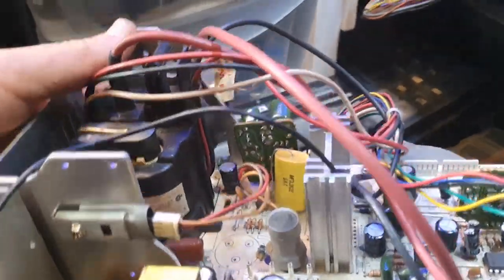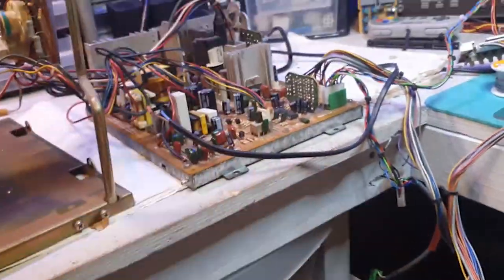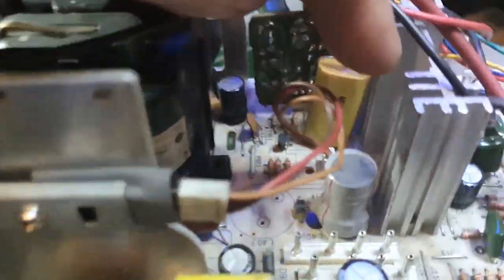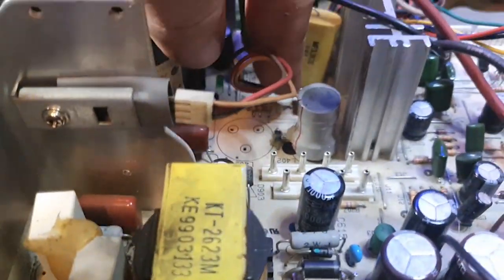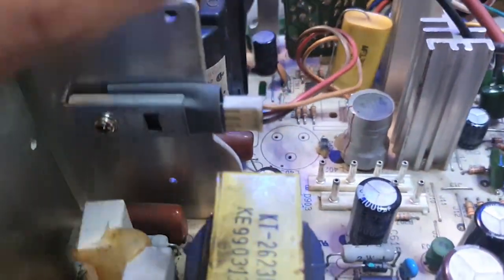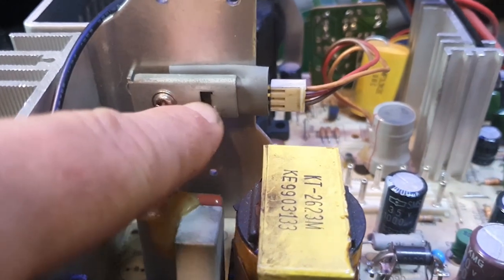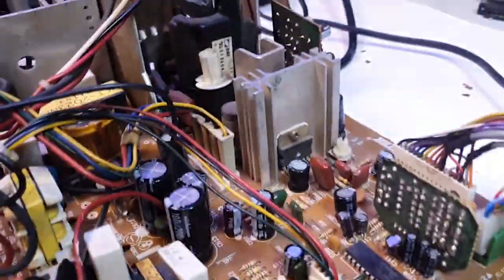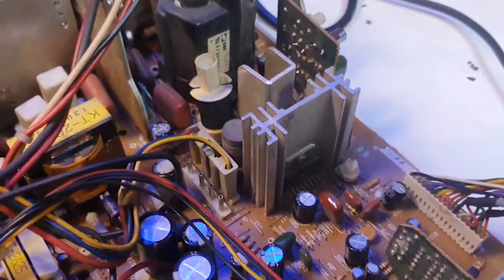There's one interesting thing in this model. This is the Kortek KTM F 10 inch. This is 14 inch, a slightly different revision, but similar schematic, similar model. So they took the transistor, or whatever it is, MOSFET, I think it's a transistor type yoke, and they put it here. They mounted it on this giant heatsink. Here they didn't do that. It's on this small heatsink.